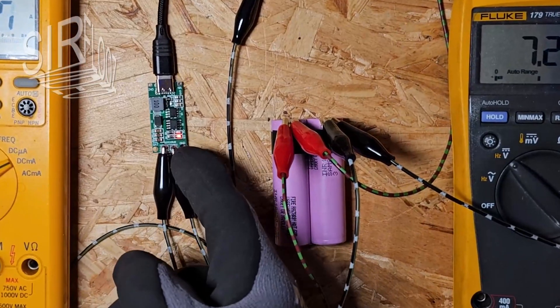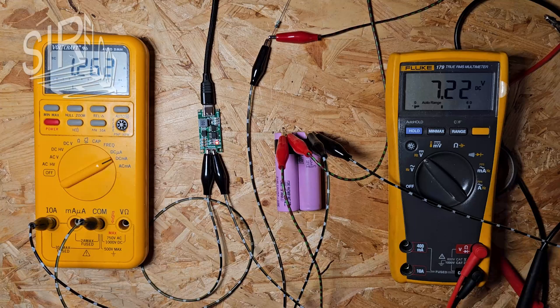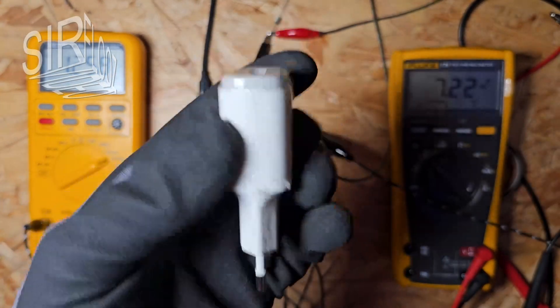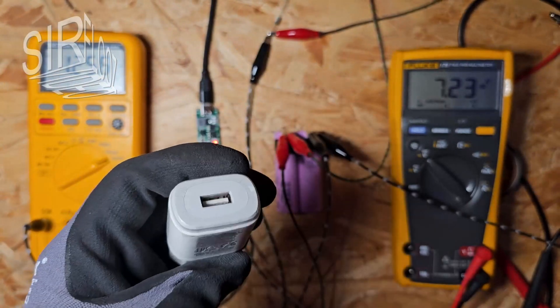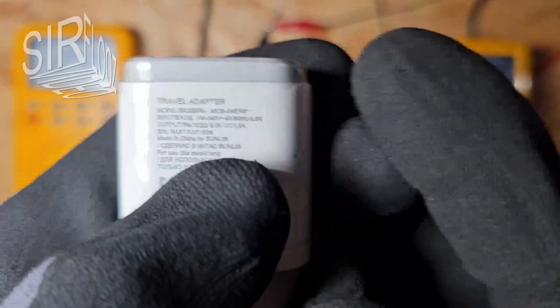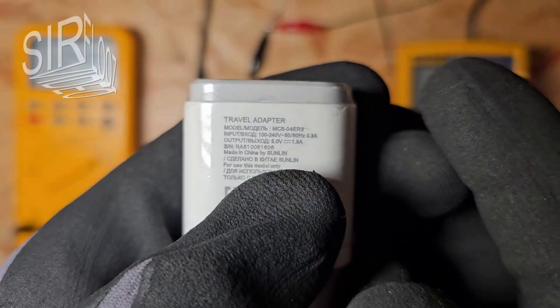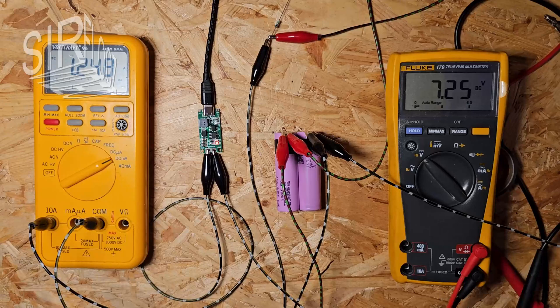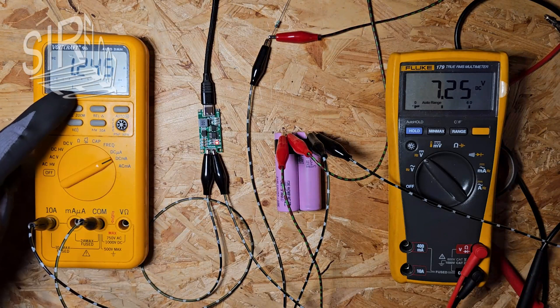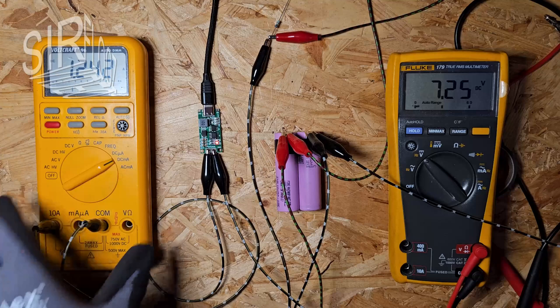The red LED is no longer flickering and the current is well above 1A. This is the USB charger I used — it's only rated for 1.8A, but the circuit needs at least a 2A USB charger. The charging current is now stable at 1.2A, which is as specified and a good charging current for my cells.